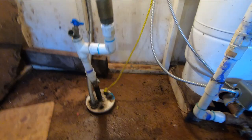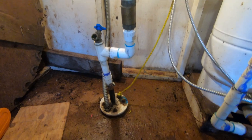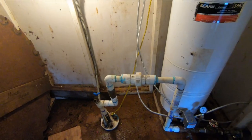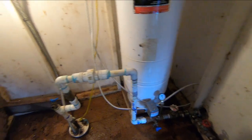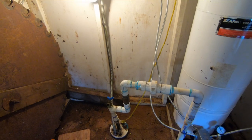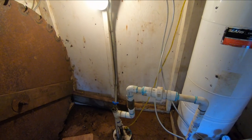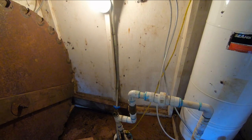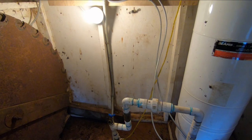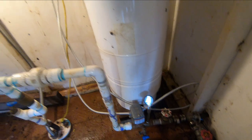Okay, so it's been about 4 days since I put the pump down in here, and everything's been working perfectly. The water was a bit muddy and cloudy for a day or so. That's since cleaned up, just from all the disturbance from the pump going down into the well. And we plumbed the well right to the bottom. So I had a weight on a string down in there, and it stirred up all the sediment. So you can expect mud and rusty colored water for a day or two after you've done any well work. Okay, so it's holding really good.